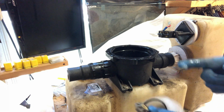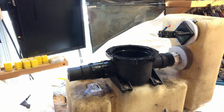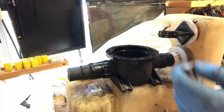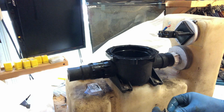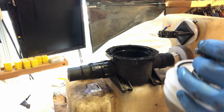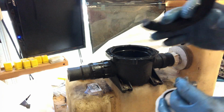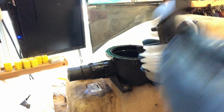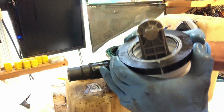Okay, they want us to grease up this place this shoulder bolt rides. Some silicone grease also. It says install the new shoulder bolt, which is right here. This is a large one, 3/4 inch hex. Okay, so there's our new shoulder bolt. Place half clamps around the neck of the bellows assembly, with the bevel side, there's a little bevel on that, down. Okay. So bevel side, put that down. So it's totally flat on the top. Okay.